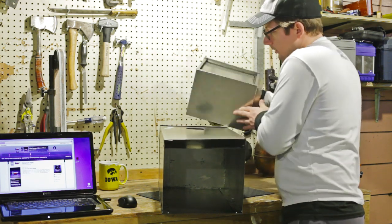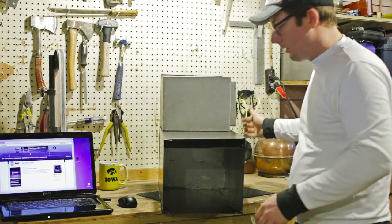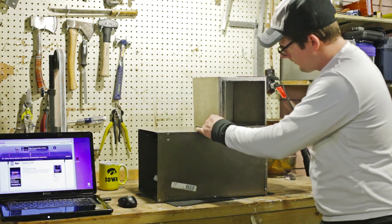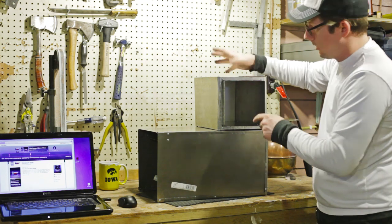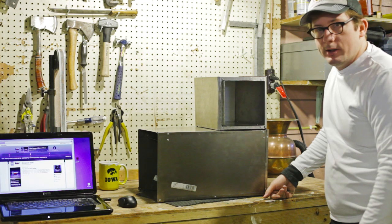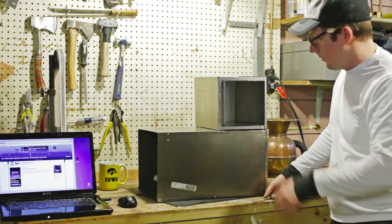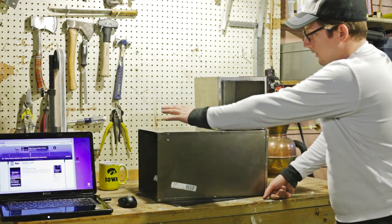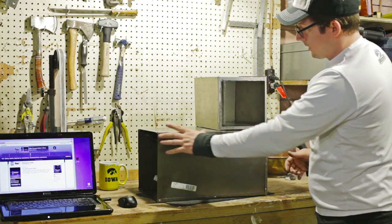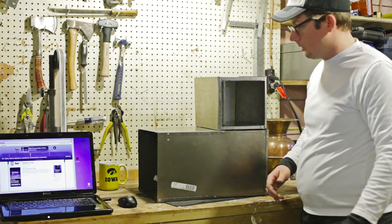And after it comes out the hole, it has to circulate around my little oven insert. So it has to circulate around this in order to get out the smokestack. So that's how I'll make the oven. I'm basically just making really good use of all the heat that I'll produce with my wood. So I'll have a baking and a cooking surface. And I made this 8 inches wide, and this cooking surface will fit any 10-inch fry pan or any kind of pot you want to put on there.